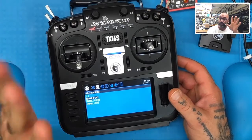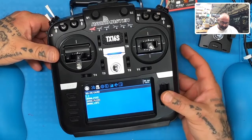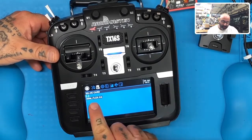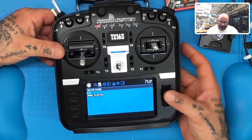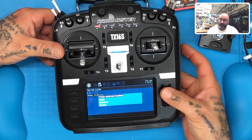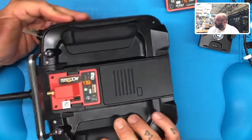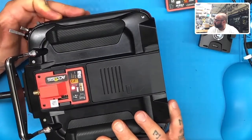I'm going to go with Flex just to have some fun — usually I'd say go with FCC. I'm not going to go with LBT because we're not in Europe. Hit Flex and Enter, then we'll use the Flex firmware. Hold it down and it will say 'Flash External Module' — click Yes. You'll see the light start blinking green and red.